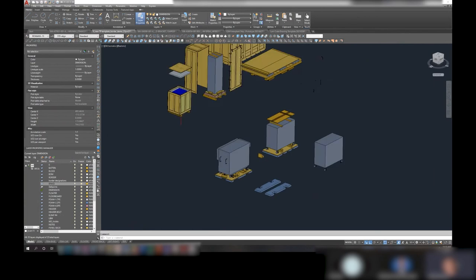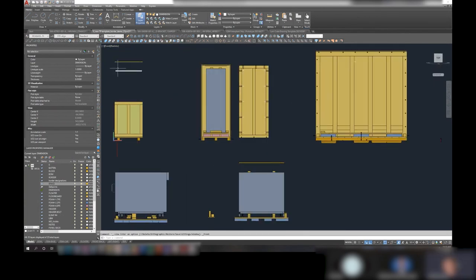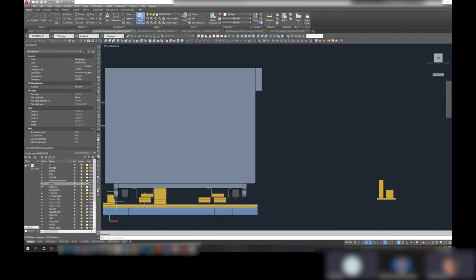That's why I say for LBM, normally the clearance, just like what Alvin asked, is good. The very minimum, you must leave 0.5 inches. And the very minimum is 2 hundred from this. You get me?